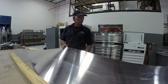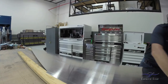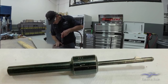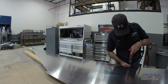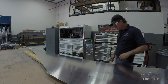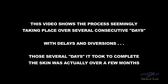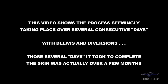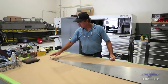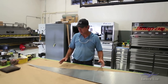I'm final-sanding with about 400 grit, and all that's doing is final feathering out my sanding marks and where the file was, so it blends that edge and takes any imperfections off. Next I've got to deburr these holes. When you're dealing with three, four, five hundred holes in a skin, deburring both sides doubles your time. I've got a really neat in-and-out deburring tool — you go in with the drill running and as you come out with the drill running it's deburring the hole on both sides. Very efficient. A lot of times we'll get pulled on another project, so this skin has actually taken me several months on and off to complete — the calendar time is substantial.